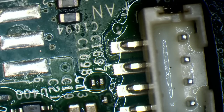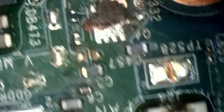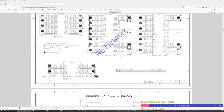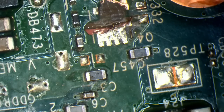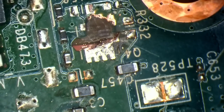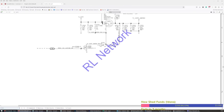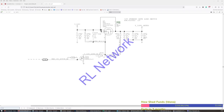I could check the schematic as well and see what that's connected to. We've got Q4 on there. The code name for the Xbox Series S was Stockton. If I do a quick PDF search for Q4 and a nearby component R332 — one match. Q4 is an AON7403 — a 12-volt standby gate load switch.